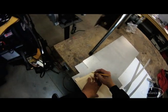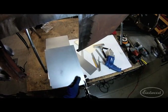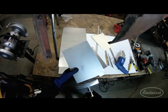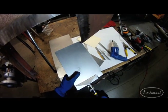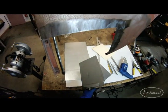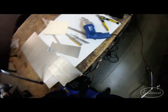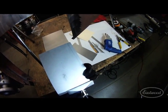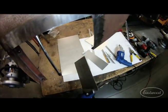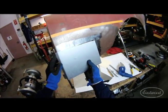Pick a size of sheet that's close to your template, unfold your template, and mark your bends. All we're doing is following the manila folder template. Go ahead and use your seaming pliers — these things are great, nice six-inch length covers a lot of your panel. Just get on your bend line, find a flat surface, and get your 90-degree break going. Rather than bending just a corner, since this piece is longer, slowly work it so you have a very uniform bend. Keep working that up and fold it over — in a couple of minutes you'll have a patch.